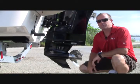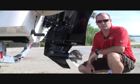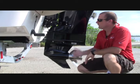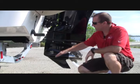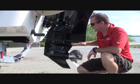We're here at the back of the boat now to show you this extreme angle. This particular boat is trimmed to a zero setting right now, and this is what you would use to get up on plane very quickly. You'll see that the plane of the boat is relatively flat in relation to the anti-ventilation plate.